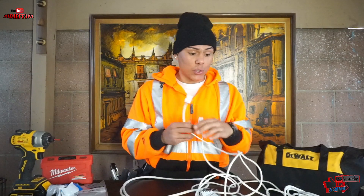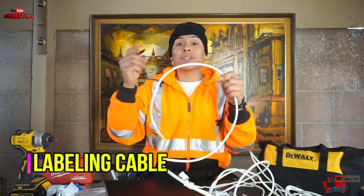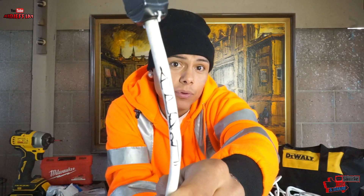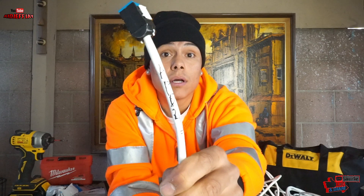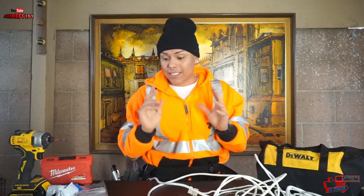Now I'm going to show you guys why you need a sharpie. The reason is how you label cable — it's not just writing like crazy. Say for example a cable is going to the IDF number 34 — you write down 'AP3034'. That's how you label, that's how mostly everybody's going to label. It's really really important to know how to label. You do it through the bottom — three numbers all the time, two lines at the bottom. Every cable is going to an IDF or MDF room, so it's really important to know where that cable is going. If you mess up and you don't label it, you gotta go and identify it and it is a mission.